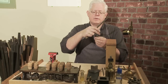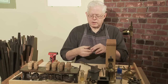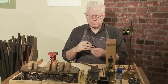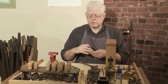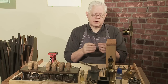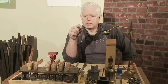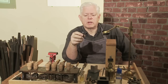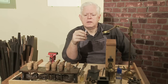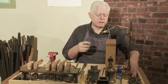Now that I've got the counter and I've drawn the letter, I need to file away these various flats on the side here. I'll make a mark here to indicate how far back I should file. After I cut these large surfaces away just to approach the letter, then I'll do the fine filing. For now we're just doing this very coarse work. I've begun to approach the letter — I've done a lot of rough filing around the outside. It's a long way to go, but I've gotten rid of the worst of the excess metal. Now it's a much finer process, so I'll be using the finer files, working under the loupe almost exclusively, and developing the letter to its final shape.